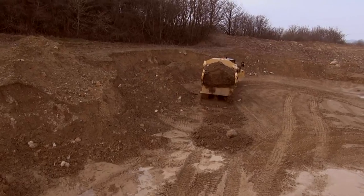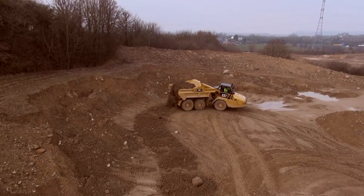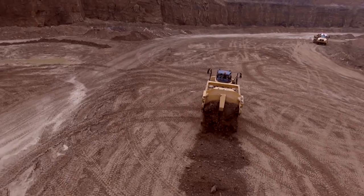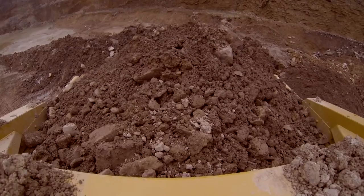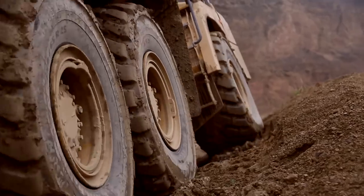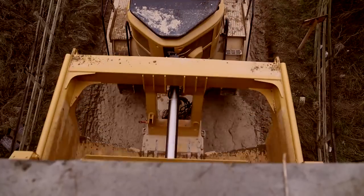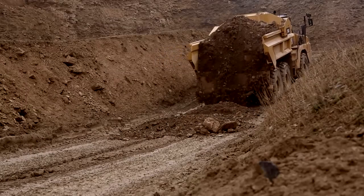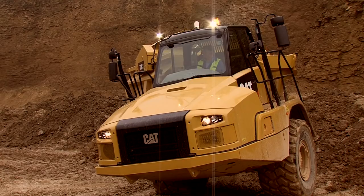If using an ejector, how the material is discharged can be controlled manually using the eject lever. Loads can also be dispersed on the go according to ground speed. That is, the faster you go, the thinner the spread. You can also eject loads statically, as you would with a tipper machine. Material can also be ejected safely on side slopes, under overhead obstructions, when going up or down grades, and with the machine steered at an angle for access into tight spaces.